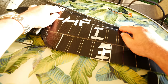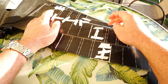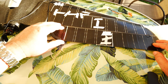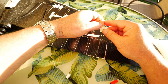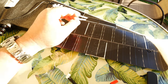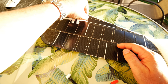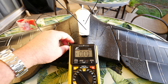That one went a little bit better. I had a slight overlap with a bit of wire on top of the solar panel so I had to unstick it — just be really careful bending these so you don't break the panel inside. Looks pretty good, aileron still working with the solar panels on it. As I'm taking the masking tape off, it's leaving a little bit of residue. A good idea would be to take a little bit of water or alcohol and rub it over the panels lightly to clean off that sticky residue — you don't want anything blocking the solar panels from getting sun for ultimate efficiency.